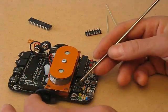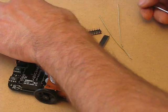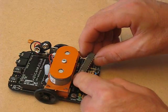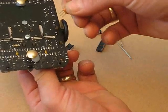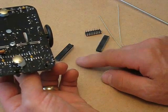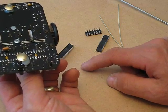I'm replacing the 18x and the 28x1 with a new chip, a 28x2, because this will allow both of the programs to be run on the one chip and a lot faster. I've also got a resonator here — a 10MHz resonator — which will solder in at the bottom and will allow the 28x2 to run at 40MHz, which should prevent all the very small pauses the mouse makes when it's having to make a decision.